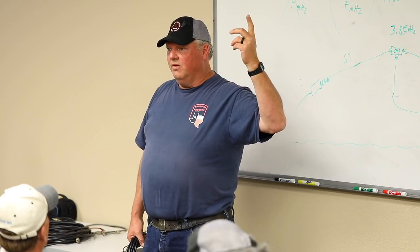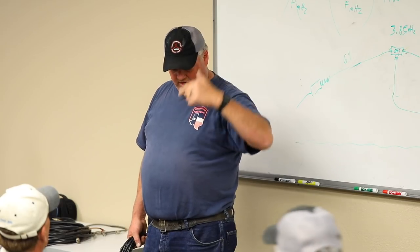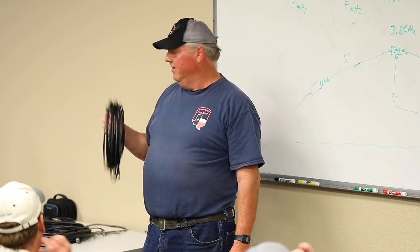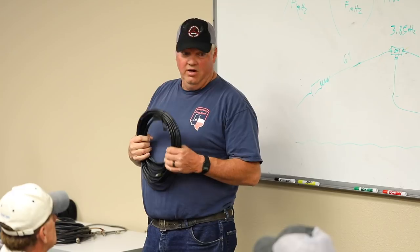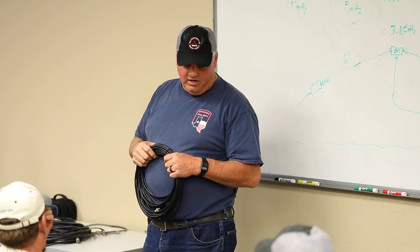Another reason would be, what if you put your 40 meter antenna up only about 30 feet, which is about right? You run it down and say, man, I'm just going to run into my ham shack, and you put 39 feet of cable. That'd be off, too. You're better off to get it closer. Are we being a little bit nitpicky? Yes. But if you want to do it right on the HF stuff, you go in half-wavelength multiples, and you use that little bit of math, and it'll get you a lot closer.